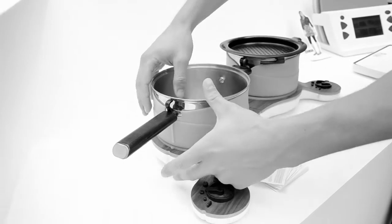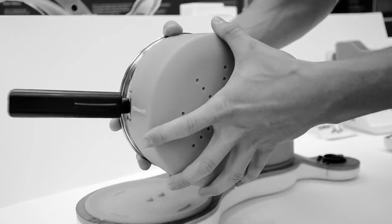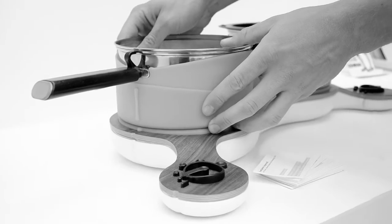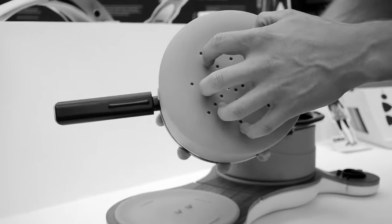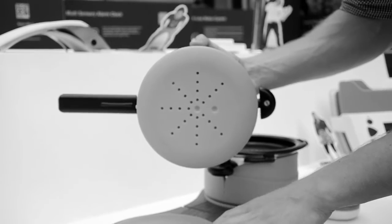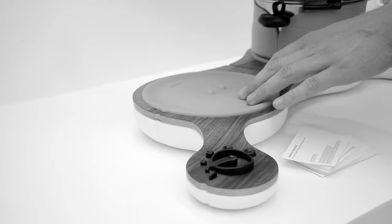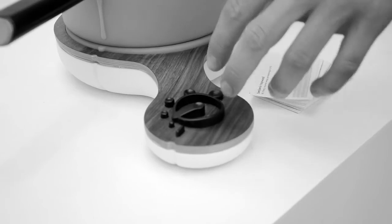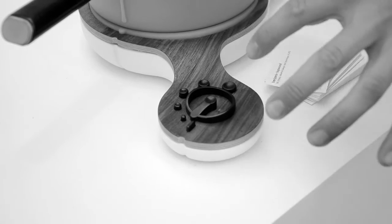The features that align run up the side of the base along the silicone sleeve and under the underside of the handle. The purpose of these is to ensure a visually impaired user can align the two parts despite their lack of vision. To reduce the surface temperature, the silicone sleeves also have a perforated base, which allows heat to escape from the base of the pan through these holes — as it doesn't sit flush on the cooking surface, heat can disperse through the outside edges, meaning on removal of the pan the surface temperature drops to around 65 degrees, which to the touch is only warm. The markings up the side indicate the on/off position, and the increase in size and depth of the recess in each bump indicates the temperature change. The asymmetric control knob indicates exactly where the temperature is set.